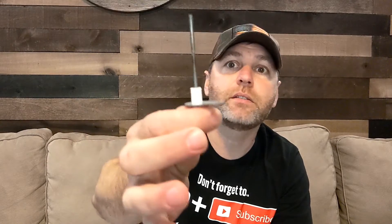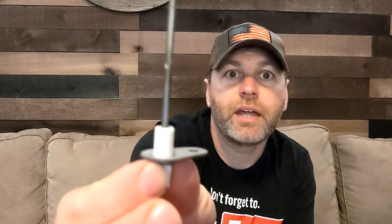Today we're just going to focus on how to get it out and how to clean it. I said you can clean it with a dollar — this is true. A lot of the old timers used to do it this way. There are a lot of different ways you can clean the flame sensor. What happens is that thing sits in there in front of the burner, so every time the furnace lights, that flame is right across there and you get a carbon buildup. This one was actually still working, but I'm going to show you how to clean it. Once it gets that buildup on there, it cannot reestablish the flame like it's supposed to, so it just needs to be cleaned. Sometimes flame sensors do have to be replaced, but not always. Usually you can just clean the thing and it'll work just fine again.